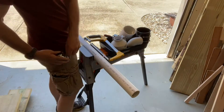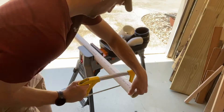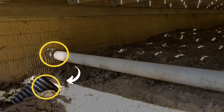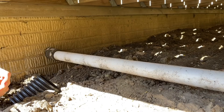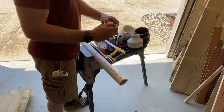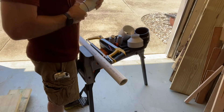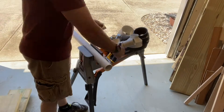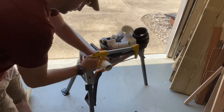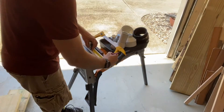Now we're ready to connect everything together. To start, I need to convert the two inch PVC from my sump pump coming out of the house into a coupling, then convert that out to my four inch corrugated. To do that, I'm starting with two inch schedule 40 PVC and making an elbow with two small extensions coming off each side.